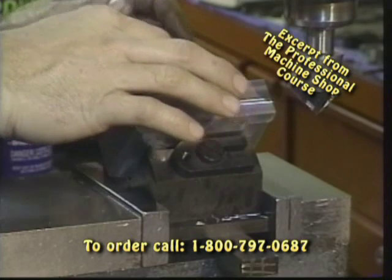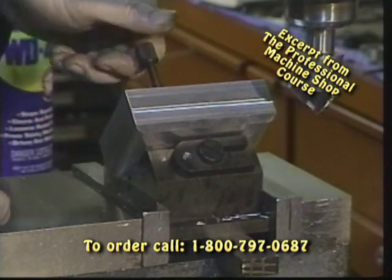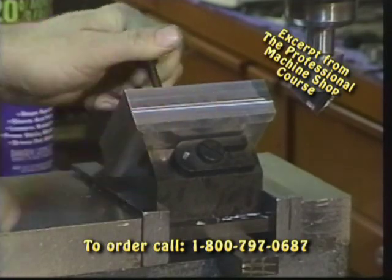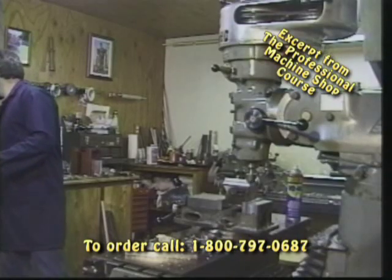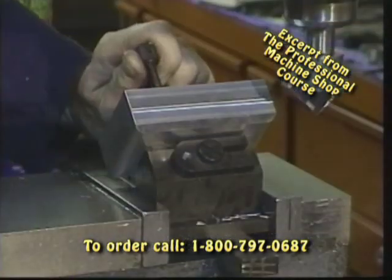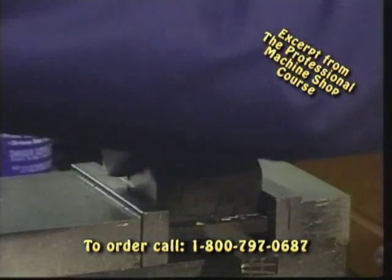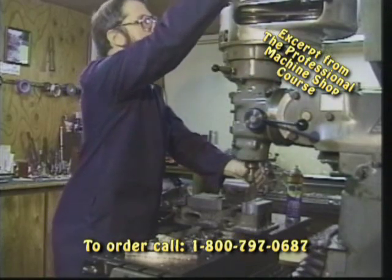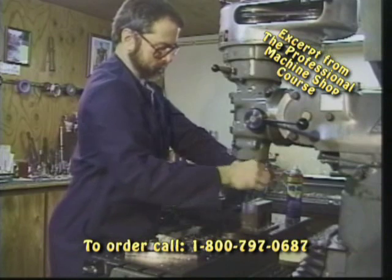Use a penny or something to insulate the work between your hold-down clamp. Hold it in place, and we can use a conventional end mill to come in and cut a bevel all the way around that part. Bear with me while I change cutters. I'll be right with you.